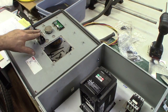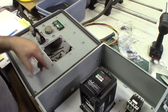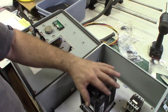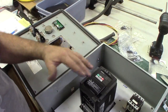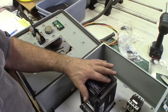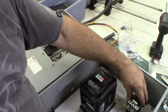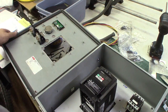It also acts as an emergency kill switch. If there's a power failure, it will drop the magnetic relay out and not restart. Yes, the VFD has that feature also, but with so many power failures that we have here, I'd rather not rely on the electronic switching and programming of the VFD. I'd rather have a hard break, and that relay will give me that backup.